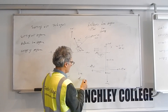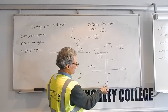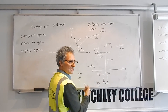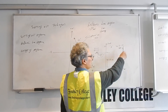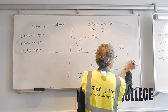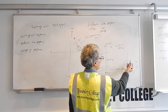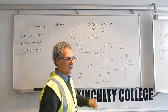So when you go and choose the line and offset, you must make sure you put the correct sign. You don't just put 2 meters — it's minus 2, two meters to the left. One of the reasons we choose the reference line to the left and below everything is so that all the points end up to the right, giving only plus line and plus offset — to avoid negatives. If you can't do it, it doesn't matter; you just have to remember to enter negative when a point is on that side.